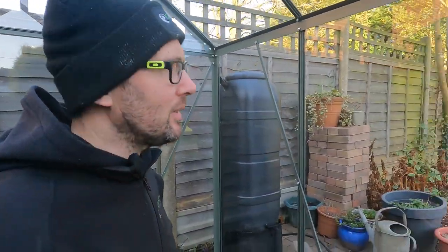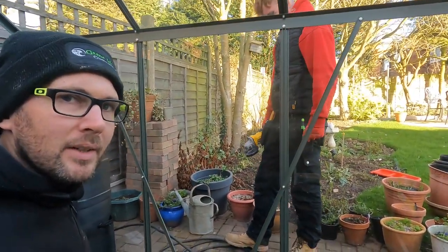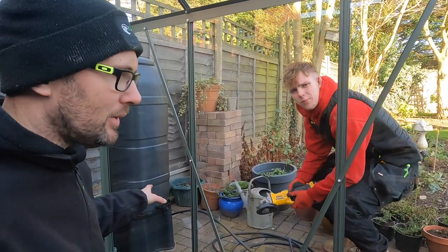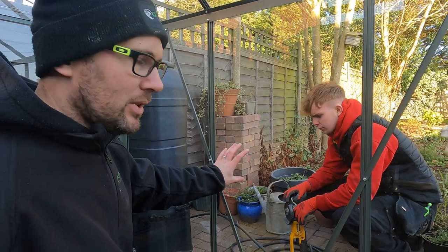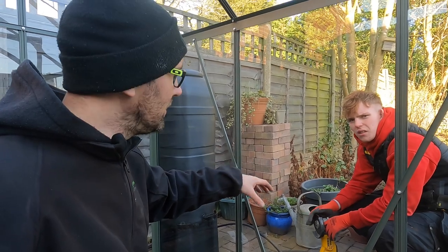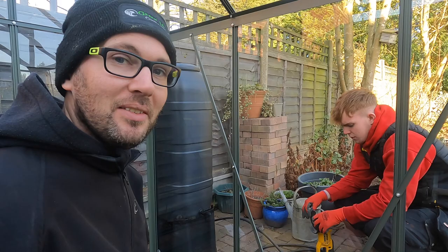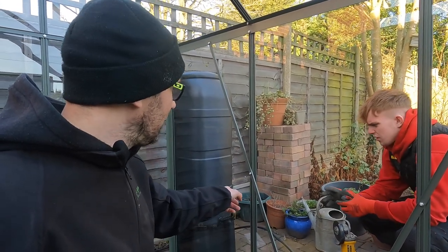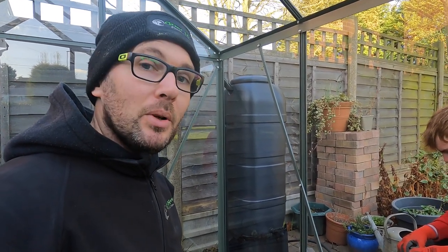I was just explaining something to Jack — I might as well share it with you. When you're cutting armoured or any metalwork with a small 4-inch grinder anywhere near glass, don't do it — move away. Make sure you don't get any sparks in contact with glass because it actually burns its way in and leaves permanent etched marks. It's not just a dirty mark you can wipe off. So position yourself so the sparks travel away from the glass, behind something like a water butt. That's your top tip.